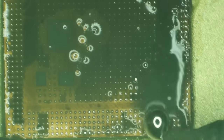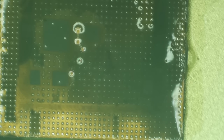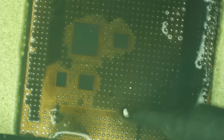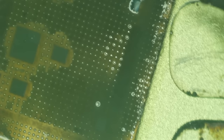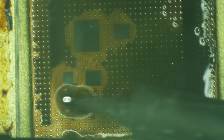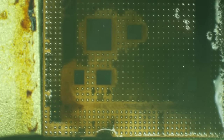And just make sure everything has been combined with this low melt. The low melt I'm using melts at 138 degrees C, I believe. It's quite a bit lower. And you can see a lot of that glue is coming off already just from my iron going past it, so that's good.